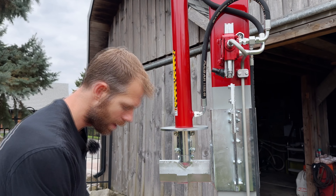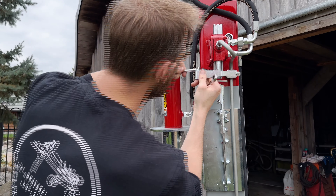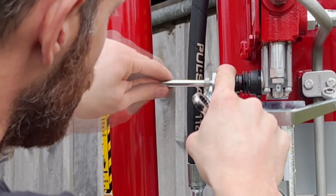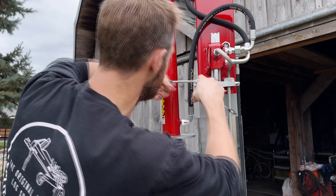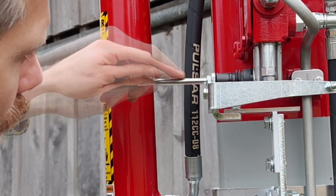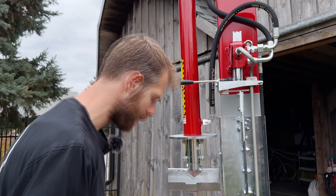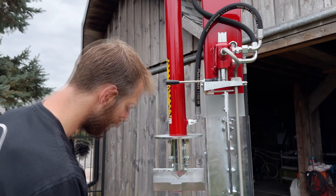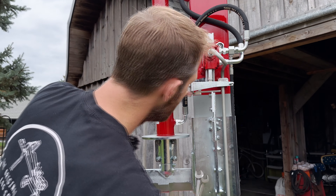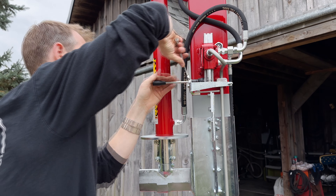Take your new assembly and remount it on there. Hold it down with your finger, then turn the valve handle in there all the way as far as it can go. You'll see the nut is backed off all the way to the shoulder — there's no existing thread — so turn that valve handle as far as it can go and it will automatically find its flat position. There is a machine shoulder in this new one that interfaces the valve, so you do not need to be concerned about side-to-side movement — it will automatically find its home. From there, put your half-inch wrench on and re-tighten.